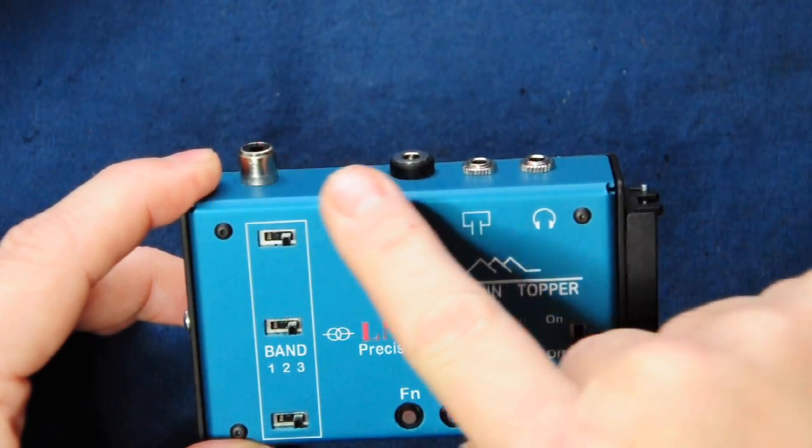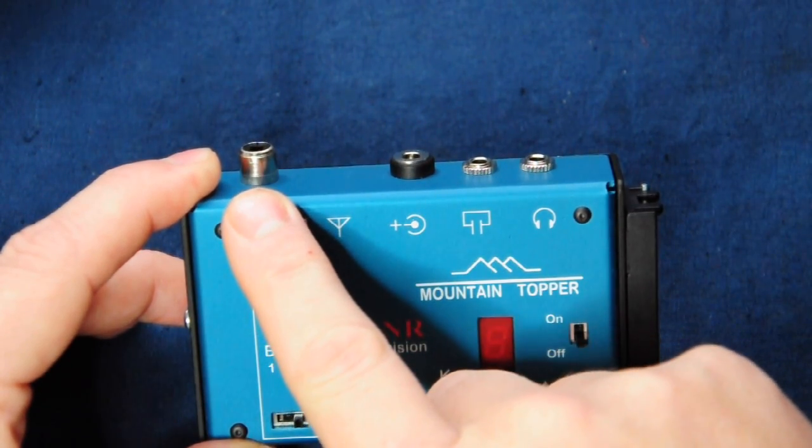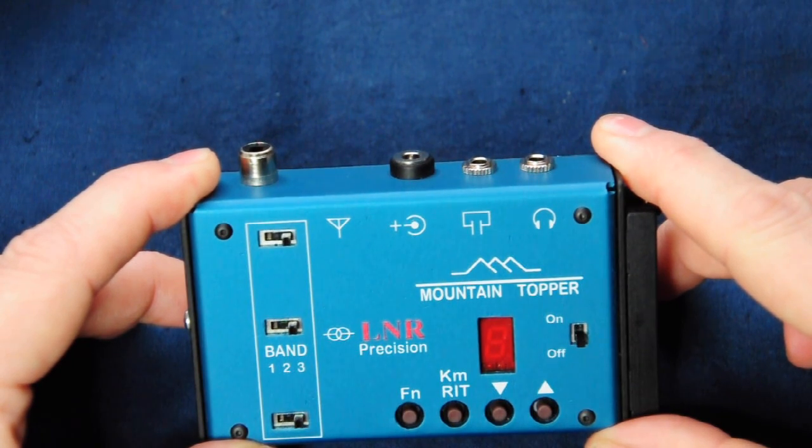All the external connections are on the back edge of this transceiver. The aerial connector is an RCA rather than the more ubiquitous BNC. A BNC might fit in there if you want to retrofit one, but it's very tight inside the radio. Actually the RCA is quite handy if you find yourself in an emergency, as you can simply push the main aerial into the RCA and twist a reflector around the outside, so it's easy for retrofitting in the field.